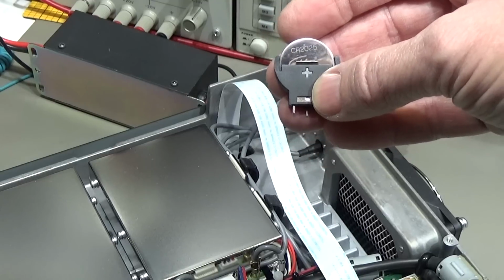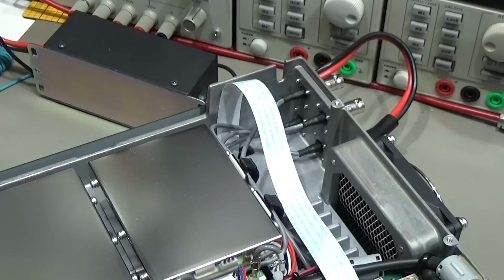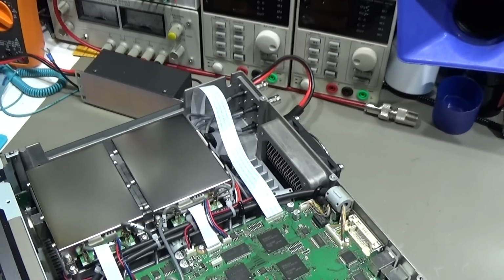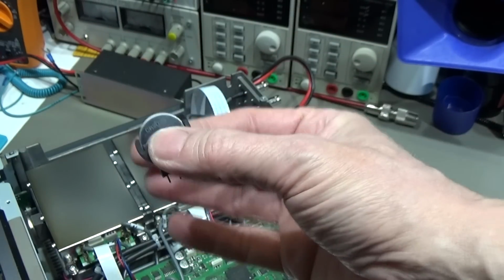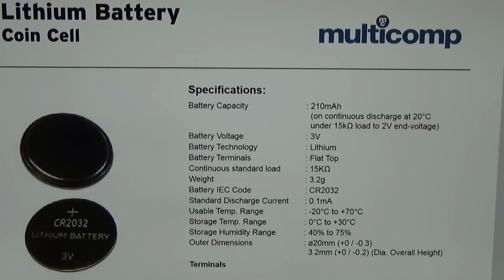Of course, we should take a little Schottky diode simply to have a lower voltage drop. That is all very easy, and that is what we are going to do here, because that is what the owner, our operator, wished and asked for: to make it possible to put in a battery which can simply be swapped out if there is a problem. That is one way, and that is what we are definitely going to do here, and I will show you how we can do it.